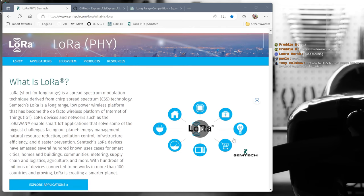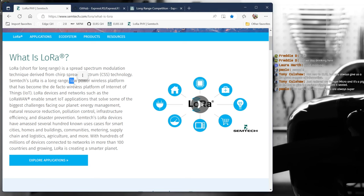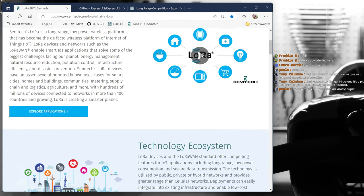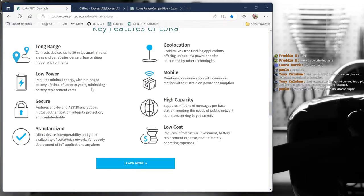I put a link in the description that explains what LoRa is. It is a spread spectrum technology, so it's a frequency hopper, and it's a low power platform designed to operate in noisy, noise floor environments, urban environments, and it's intended to have long range under low power. There's a link by Semtech in the description, so if you want to read in detail what it is, feel free to do that. But the net of it, real simple, is that it's simply RF technology. It's just a different way to modulate RF frequencies over the air.